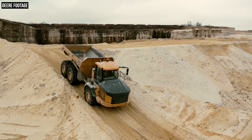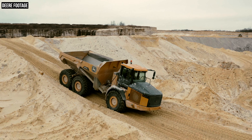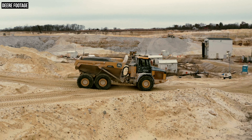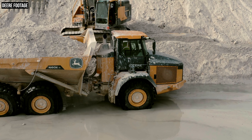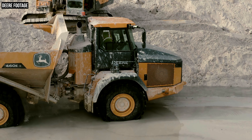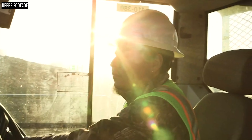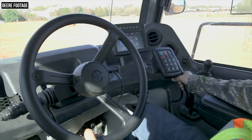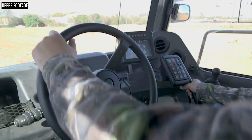There's also a feature called descent control. If you're going down a steep grade and get into the service brakes, it's going to know to start applying more retardation based on the characteristics of the truck. Beyond all the productivity and efficiency improvements, Deere is also introducing a new cab. The changes in this new cab are all about more automotive styling — fewer switches, everything more tightly integrated, easier access to climate controls overhead, and Deere has integrated the turn signals, lights, and wipers all into the steering column.